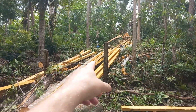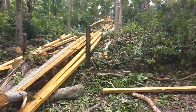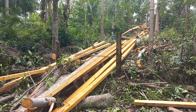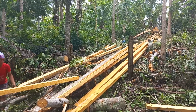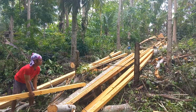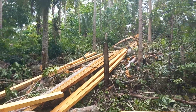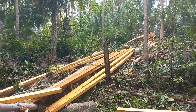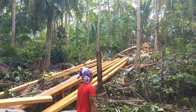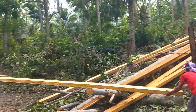And this log down here has got to be cut what's called plain sawn, which is cut through the tree side to side, which will produce these nice through cut log faces, which will be used for the headboard of my bed, and maybe another bed out of it. I don't know. I might get the bed top and the foot of the bed out of those log pieces. We'll see. I am watching the guys here.